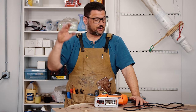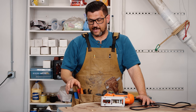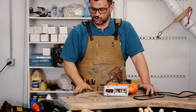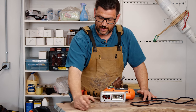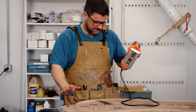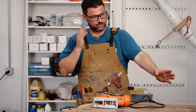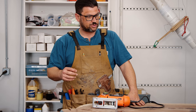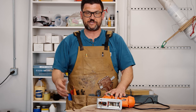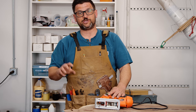We've got our butterfly keys in and our epoxy done — we are ready to finish this slab up. When I'm finishing a slab, I don't like to always make straight lines. Looking at this slab, that just doesn't make sense. So I'm going to try to keep a live edge slab look around this corner, using a jigsaw to randomly go at the same sort of angle that the slab goes at and cut that off. The far end I'll do a straight bevel, and here I'll probably also do a straight bevel. When you're working with live edge slabs, you want to really think about the feel and design of the piece — don't just start cutting stuff off in straight lines if it doesn't make sense.